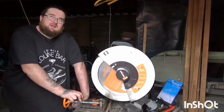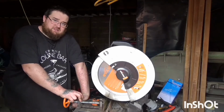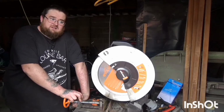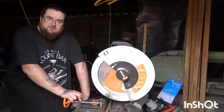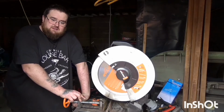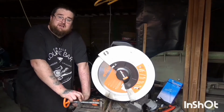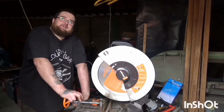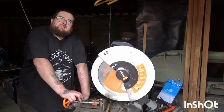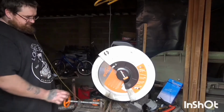That's what she said. And then if I cut the bolts 6 inches long, turn down 5 of the 6 inches, and then leave 1 inch as is and machine 2 flats onto it, cross drill it, then I should be able to put the bolts through that. Yeah, it should work. We'll try that.